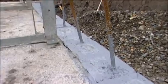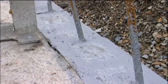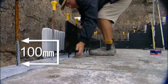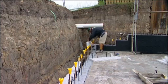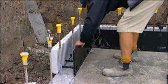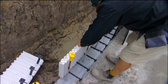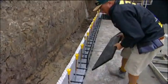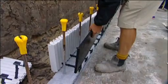Liquid membrane waterproofing is painted on the ground and up the starter bars 100mm. This becomes the damp proof course. To assemble, simply install a hard clip in the bottom of the first panel and place over the starter bars. Then locate the reform panel on your set-out lines. Continue this process for the perimeter of your building.